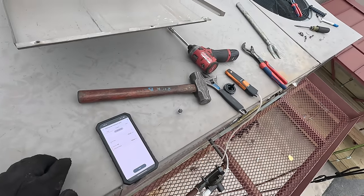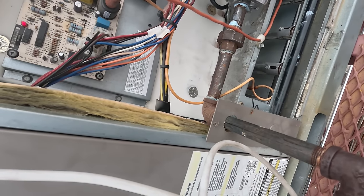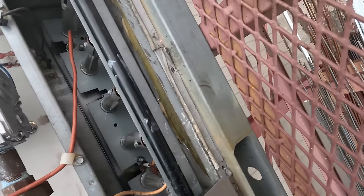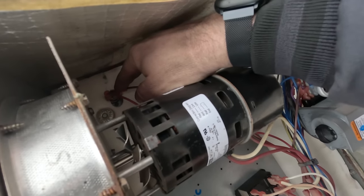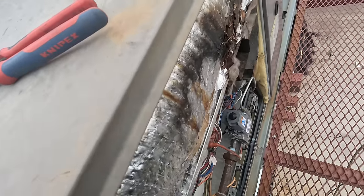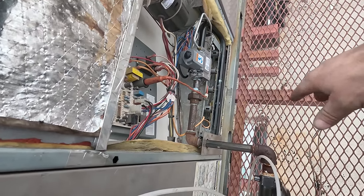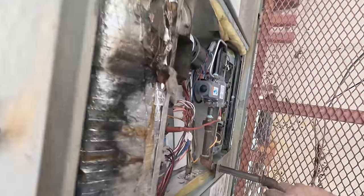It's at 13.3 when it's off. Let's look at the blink codes — six blinks: one-two-three, one-two-three. High temperature switch open. So we tripped that enough times it caused an issue. See that right here on the front — heard a click. The fan didn't kick on one of the times and that's what shut it down. So in theory, if I was like some people, I'd just come in here and hit that reset button and leave — that would have caused a problem. Let's go ahead and let it start over now.